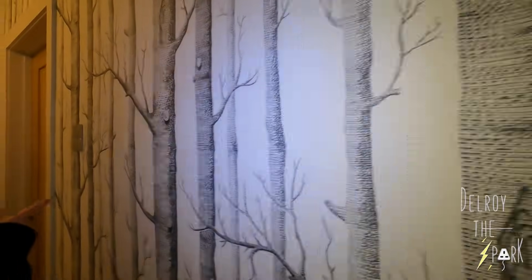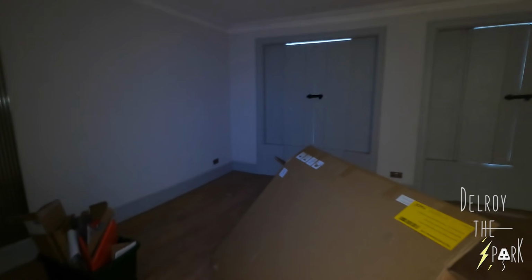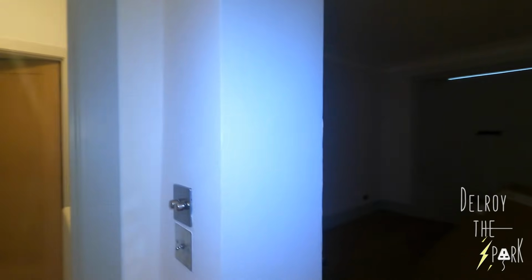So that, if you go into here. Okay. But clearly one of them controls this as well, it's just a downlight bulb. But I want to put in, if possible, a new one that controls just that one. All right, so... It's been dead. Oh, okay. So you want a separate switch here? Yeah. Okay, another switch here. Well, what we do, we change that into a 3-gang. Yeah, that's what I thought. So I thought it would be simple enough.